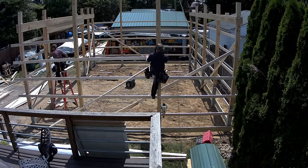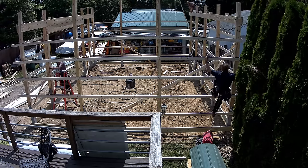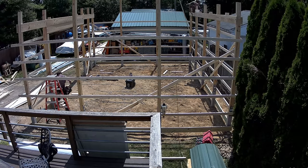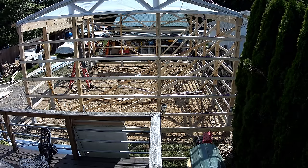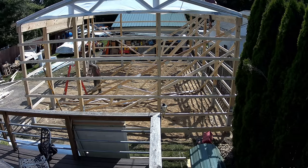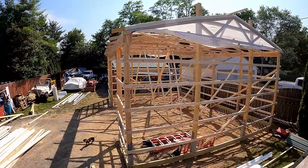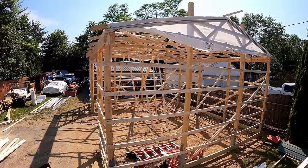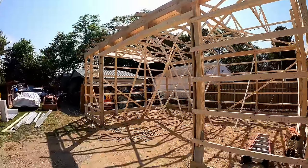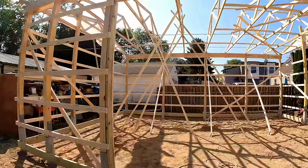Most therapeutic to watch these guys work - climbing up and down using all their stability muscles, getting a great workout throughout the day. There's the trusses going up, 3/12 pitch on those. Good idea that they wrapped them on the ground before putting up the gable ends - makes it much easier. And here we are at end of the first day. It's not quite as huge as I thought it would be, nice 12-foot wall, came out straight and true. Guys did a great job. I tried to help a little bit with lifting stuff like the concrete, not that they needed my help, just trying to be of slight assistance.